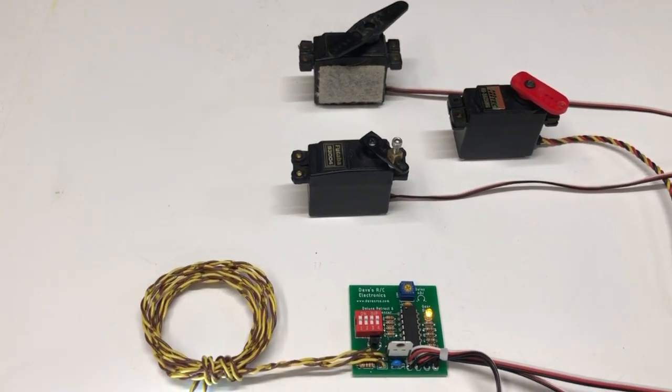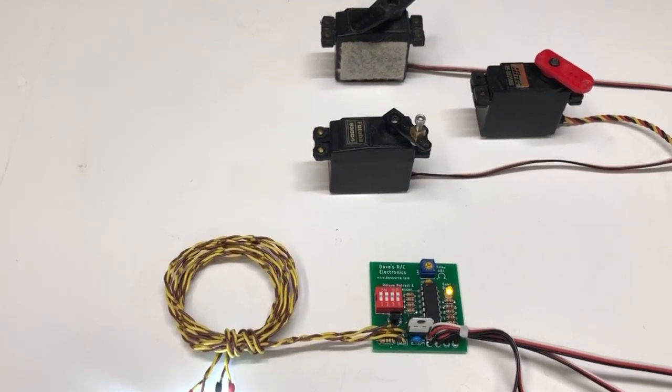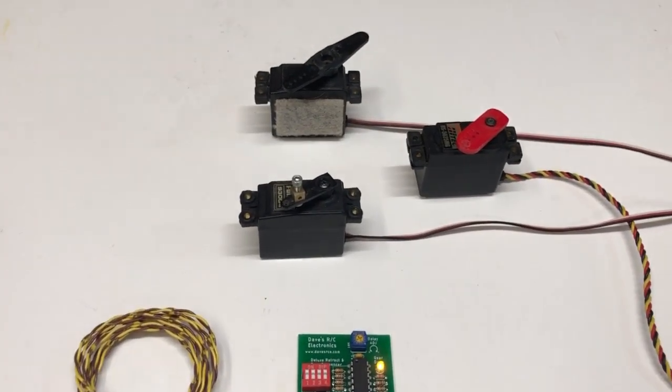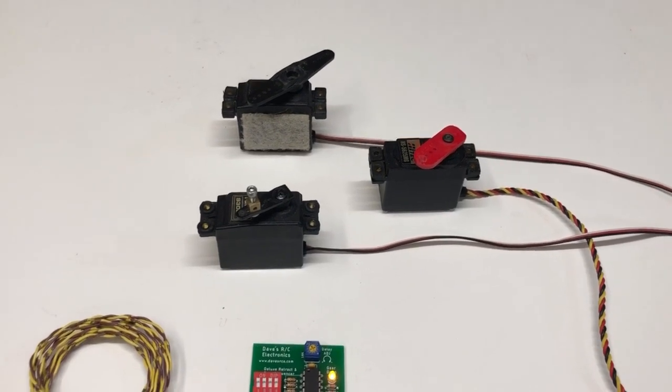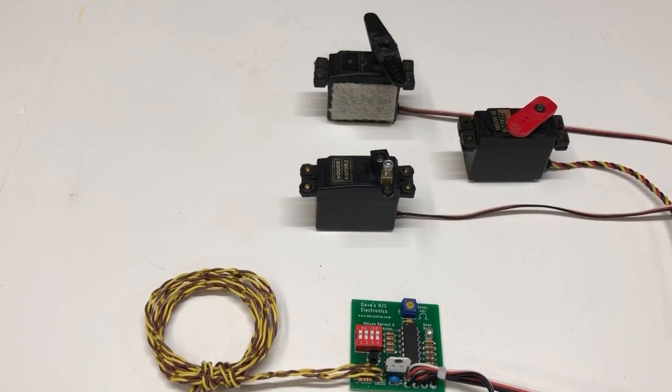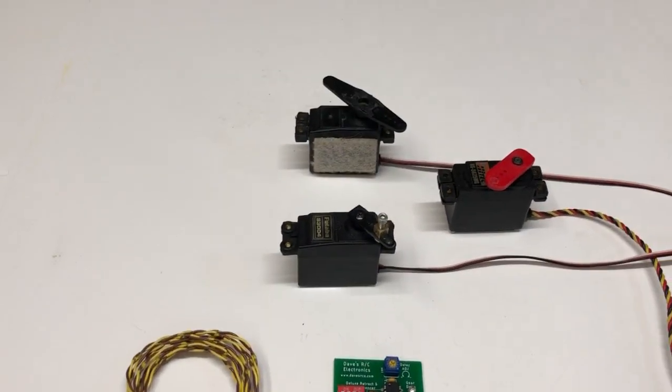Okay, now we're going to toggle the switch. We're going to go to gear up. You'll notice that the aft gear door is open. The unit goes to the gear up position, and then after a suitable delay, both gear doors will close and the landing lights go off.